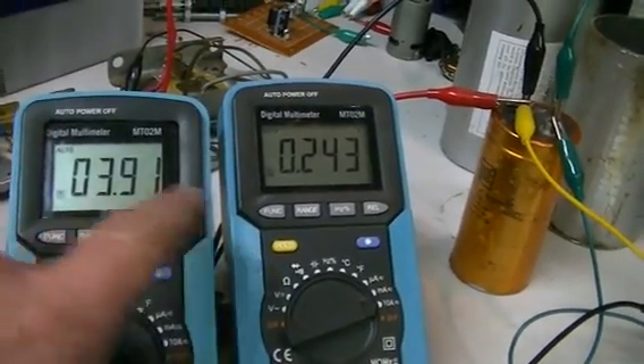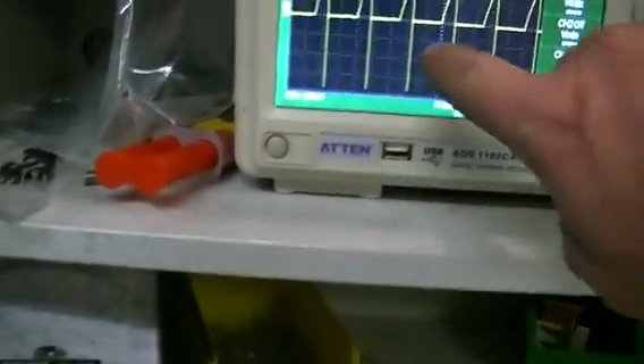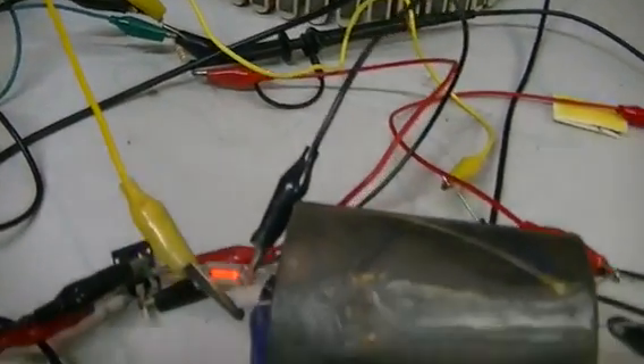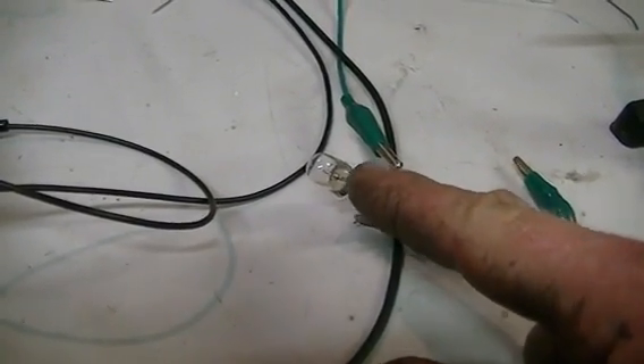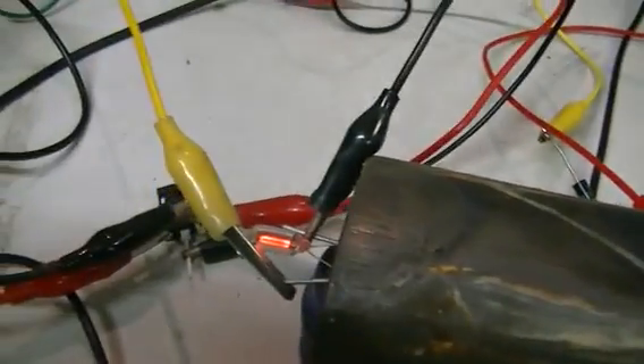The meters show input voltage, input average current, and load not connected. So now we're going to take this inductive kickback here, which is lighting this neon at the moment - it can light that neon because we only have 100 ohms across our primary coil, which is not enough to pull the voltage down. However, this large low-resistive load, which is about 6 ohms, is enough to drop the voltage down.